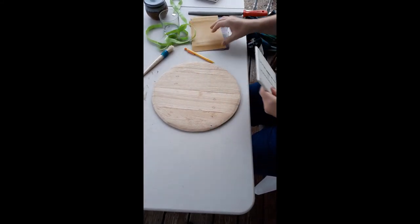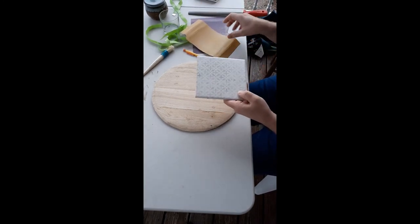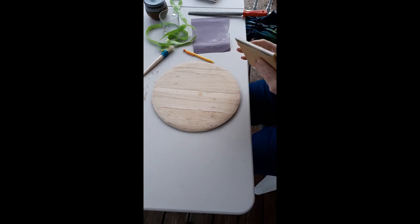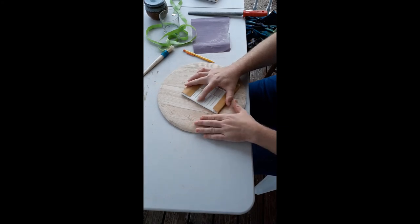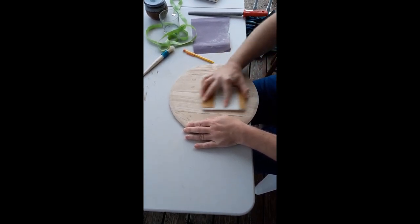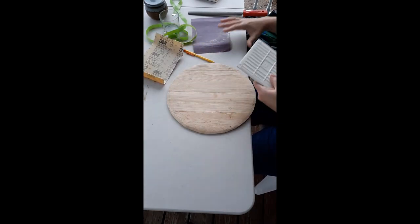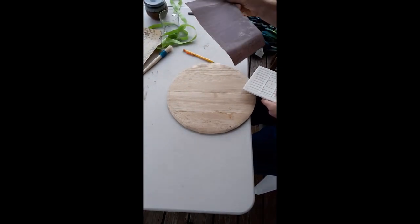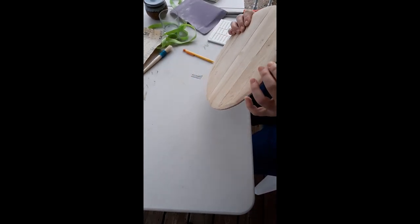To finish off, what's been working pretty well is taking a tile that I normally use to tape sandpaper to for sharpening utility blades, and I just put the sandpaper over the tile. It's pretty much like a sanding block, but I like it because I know it's flat and it has a little weight to it. I'll go around the edge after doing the surface. Before I paint, I'll probably go down to 320 grit — mostly using 120 right now. I'm going to go around this edge and get the whole thing down to four millimeters thick.